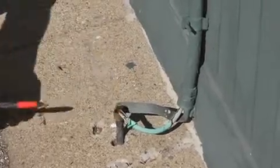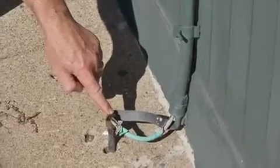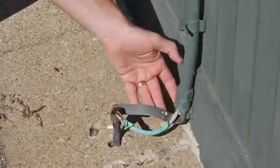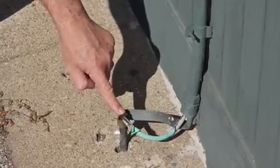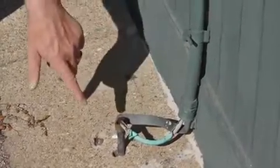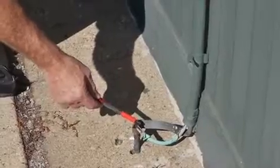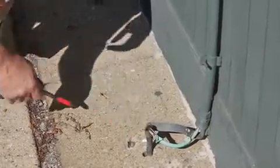The purpose of this ground is exactly the same as the purpose of the ground that we saw in the building that was attached to the cold water main. It takes any high voltage and carries it through this bonding strip into the copper ground rod, where it is sent into the earth and where the electricity dissipates. Now this ground only gets used under a very high voltage situation, such as a lightning strike.